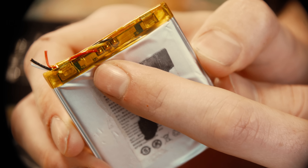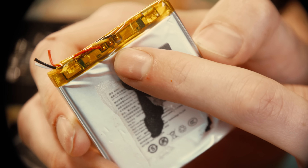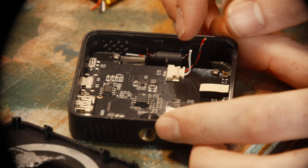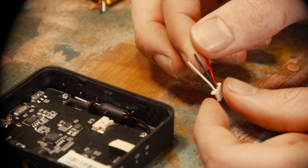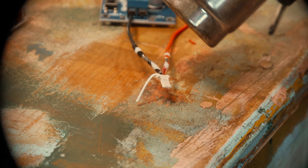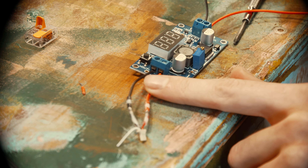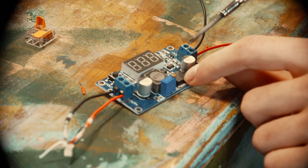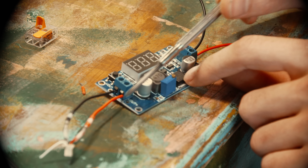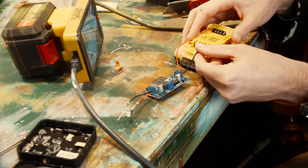I got the battery off the case. Now I can see what these cords go to. I'm seeing P-plus, T, and P-minus — so it is just standard red and black. Could have guessed that, but better safe than sorry. Now I can solder something up to this power plug and test it. Get that little guy soldered up to some bigger wires, and then that can get plugged into one of these voltage step-down converters. This will just take in the 20 volts from a drill battery and put it out to 5 volts, or whatever I need for this.